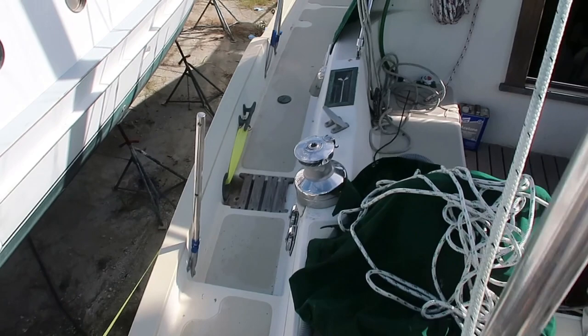Now we do have some little imperfections still that we missed in our fairing and filler step yesterday. There's maybe 10 little tiny spots that we just want to get a little filler in before we put on the second coat. So we're going to do that, sand off the filler, rough up this sanded paint with 320 sandpaper, give it another solvent wipe, tape everything off again, and then do our final coat of paint. That's kind of what our plan is today, but trust me, this thing is looking real good, and we'll give you some glamour shots once we get that final coat of paint on there.